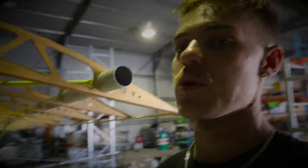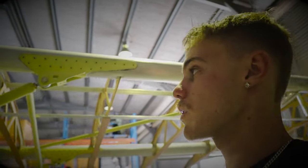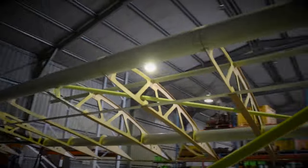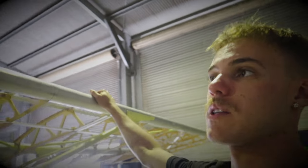Talking about the wings — they're obviously on the aeroplane. The actual wing bolts are not installed because I don't want to just leave them sitting here exposed. It actually has dummy bolts in it to pin it all and hold it here. But yeah, this is how your wing struts attach — this is the attachment point. You can see it has rivets on the leading edge and trailing edge. Very strong. There's also doublers inside there. These wings were factory quick build at the factory, so they did all this work. They rigged it and I haven't had to touch a thing. It just all went in no problem at all. It's worth the extra money.